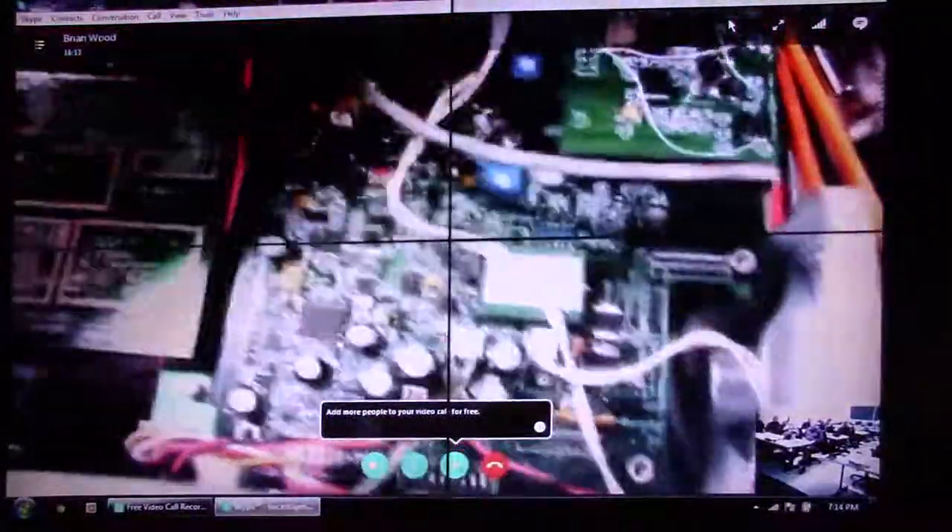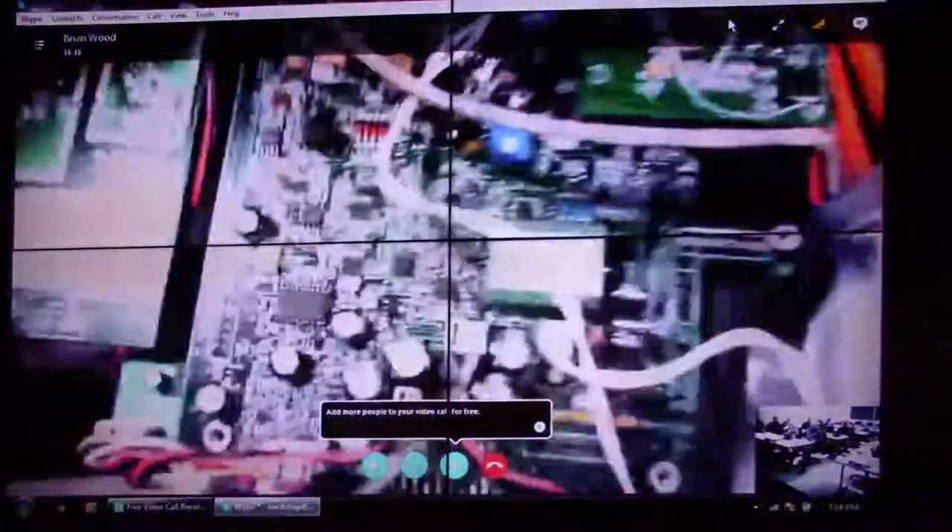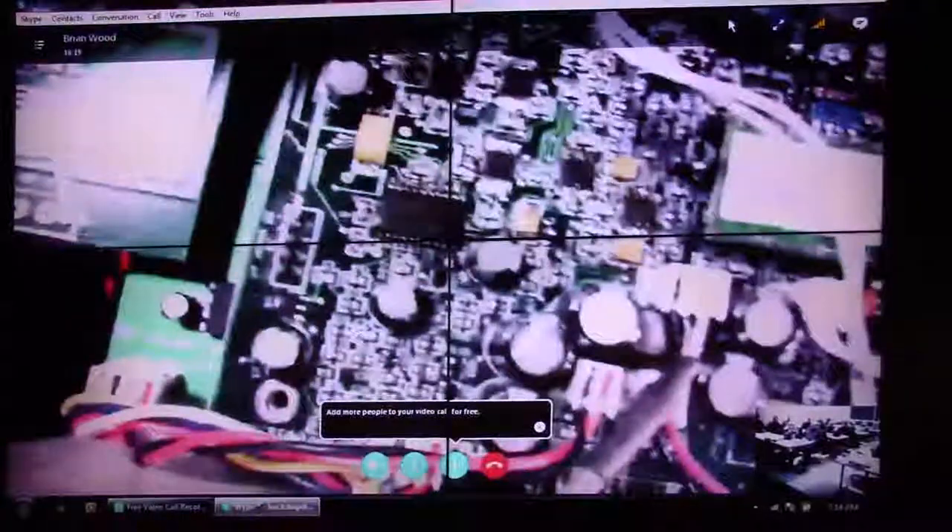The next board is the receiver itself, right here. That's the FM receiver, and the rest of it is basically the receiver. There's a notch filter that you can snap in over here. If you look from the side, you can see a sandwiched arrangement — receiver board on top, motherboard, the IF filter board I showed you earlier. You can see those crystal filters underneath. There's also a front end board in the back of the instrument, and that's a full kit.